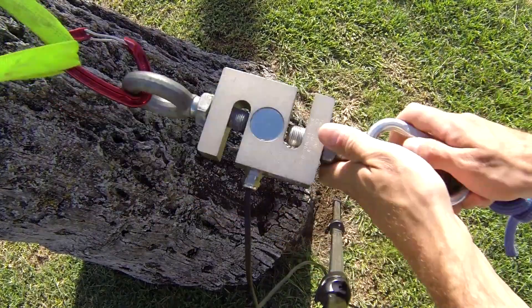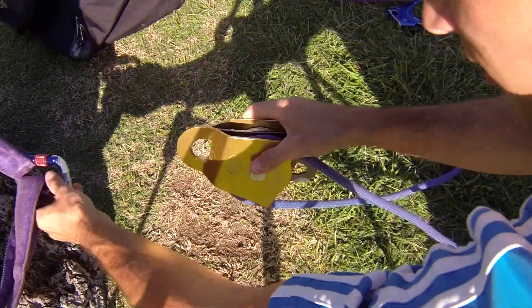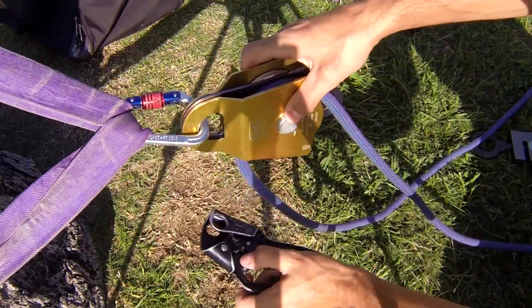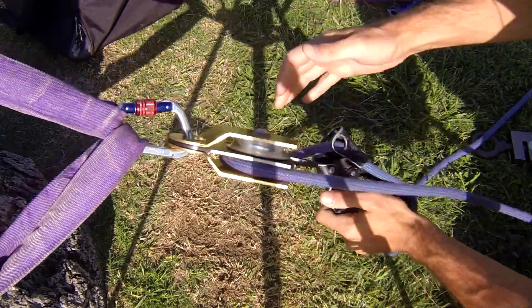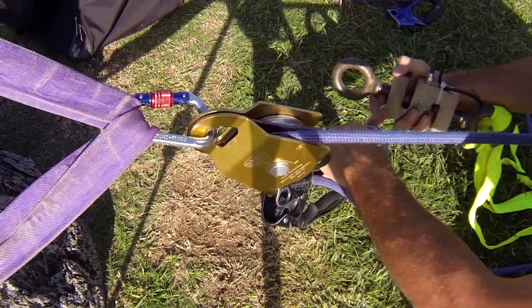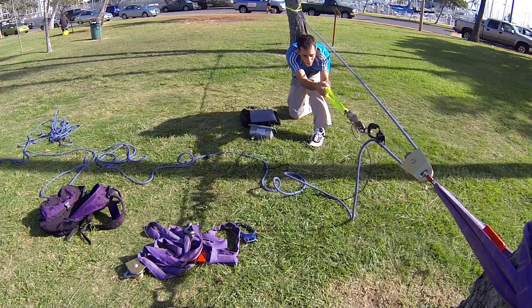Here I show you how I actually test their efficiency. Please note that these cuts are actually staged. In the real test, I had two strands of rope running through this pulley. The second strand was pre-tensioned so that when I pulled on the first, it would stay in line and not hit the side plates, therefore skewing the results.